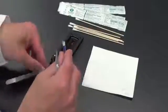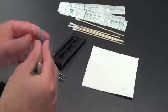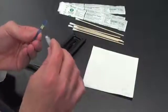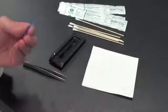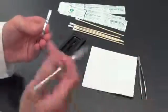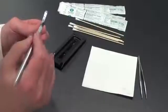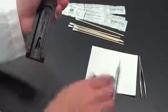And this last window in the middle will be a little tricky to remove. So what we want to do is gently hold the lens by its side, and at an angle, take the knife and gently remove that last piece of adhesive. The area that we removed exposes the adhesive. So we have a larger area in the middle and then a smaller area at each end. This top area has a smaller window, and we're going to put that here